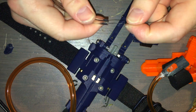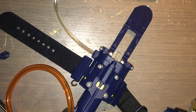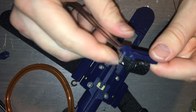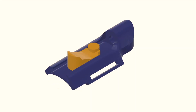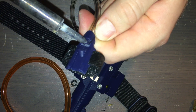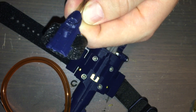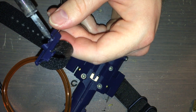Next, take the smaller tubing and thread the thread coming out the side port through it — you should be able to pull the trigger snap latch by pulling the thread through this tube. Insert the other end of the tube into the finger track, which has a small band to wrap around your index finger. Make sure the finger switch slides nicely into the finger track without any friction — sand both parts if needed. Move the finger switch to the proximal end of the finger track, wrap the string coming through the hole around the capstan on the finger switch, then either tie it or melt it into place. Melting is a more surefire method.